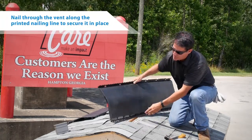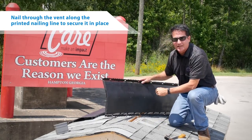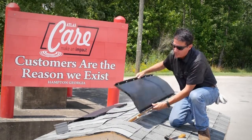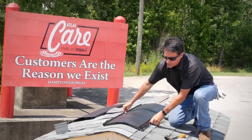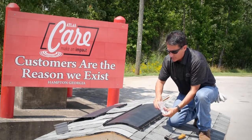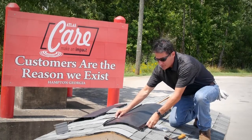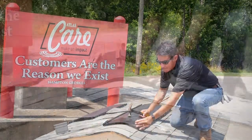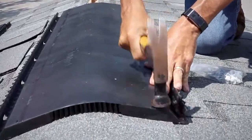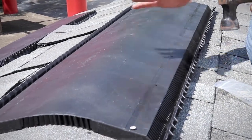This particular piece of ridge vent has pre-molded nail holes and that's just really for tacking it down. You're going to install the hip and ridge directly on top of the vent. So line your vent up, use the 3-inch nails that come supplied with the product if you've gotten that option, and just tack down the ridge vent, making sure that you're consistent and straight across the ridge.